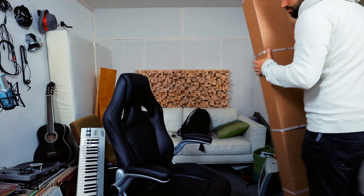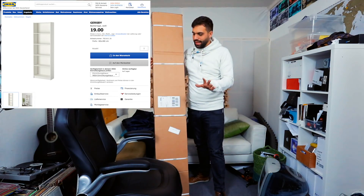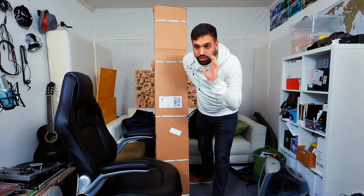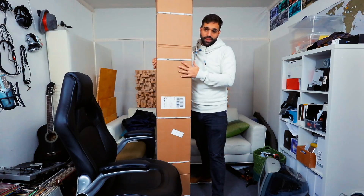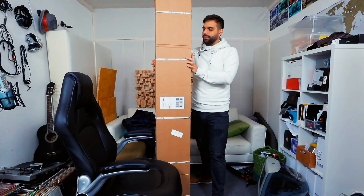The side absorbers are actually pretty easy to make. They were made with an IKEA bookshelf, rock wool, 30 minutes of time, and they're all done. I ordered another one of these bookshelves — let me get it. It's heavy. I think this one is called Gerbsy or something like that. It's the thinnest, smallest, cheapest bookshelf IKEA sells — usually 20 bucks. I got this one for free. This video is not sponsored by IKEA. I don't really like their stuff, but buying this is way cheaper than building a frame yourself, and it has exactly the right measurements for the filling that goes into the absorber. Now comes the fun part — building this.